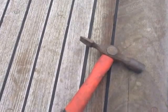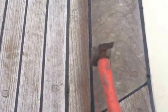Another tool that we have as surveyors is the sounding hammer. One of the things we always do is tap-test most of the deck. In this case, what you can hear here is sound teak that is well adhered to the underlying deck. As we move forward, you can see that this plank here has lost slight underlying adhesion and consequently will probably need to be lifted and rebonded to the underlying deck. So here you can hear the teak is sound, and here the teak is loose.